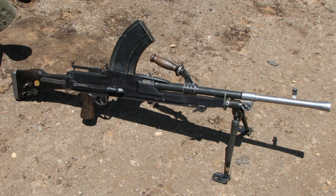A slotted flash hider similar to that of the contemporary L1 rifle and L7 general-purpose machine gun replaced the conical flash hider. The change from a rimmed to rimless cartridge and nearly straight magazine improved feeding considerably, and allowed use of 20-round magazines from the 7.62mm L1A1 self-loading rifle. The 30-round magazine from the L4 also fitted the L1A1 rifle, but the magazine spring was not always strong enough, remedied by stretching the magazine springs. Completion of the move to a 5.56mm NATO cartridge led to the Army removing the Bren L4 from the list of approved weapons and withdrawing it from service.